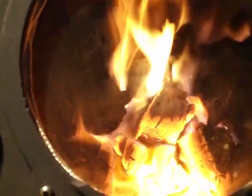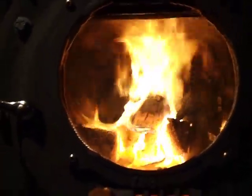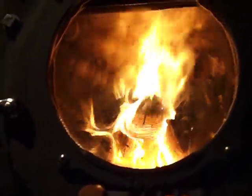Basically I'm seeing a combination of colors. There's a lot of orange because orange really stands out. It wasn't going hot enough — we'll give it some more air. Blue flames is what we're looking for. I can see some blue flames in the logs as a result of the primary air. Flames basically go up and split, going to the left and to the right toward the back.